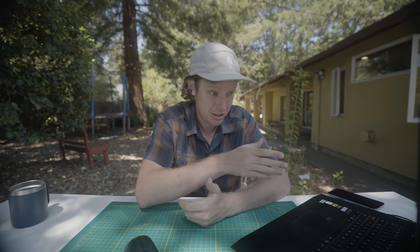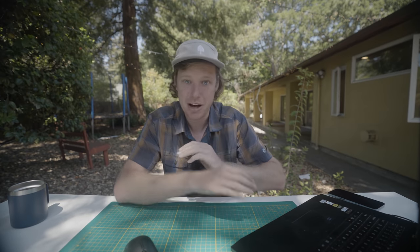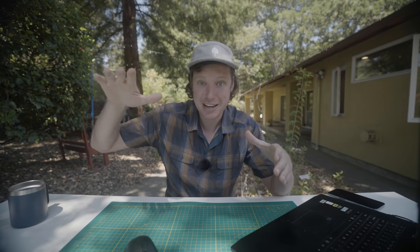So just looking at that one point, that would be one instant in time. And we're going to do that right now. But also this finding that it seems that it's undulating, and I've done a bunch of cross sections, it's not doing it consistently. So there is some sort of floating going above the data sets and below, and this also checks out with all the ground controls, all those points as well. You'll see that if you line the data set to the GCPs, it'll be, you know, high in some of them, low on some of them, but it's not consistent. So that's a very interesting finding.